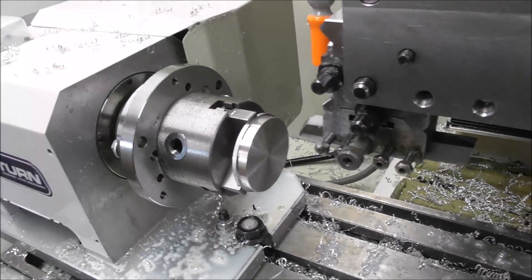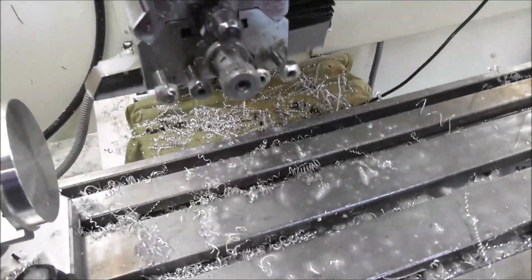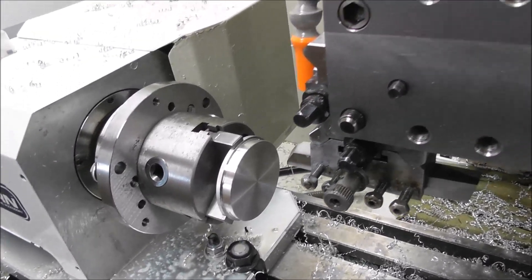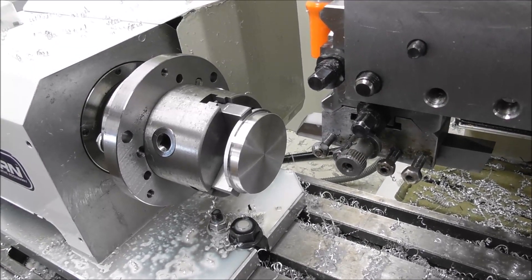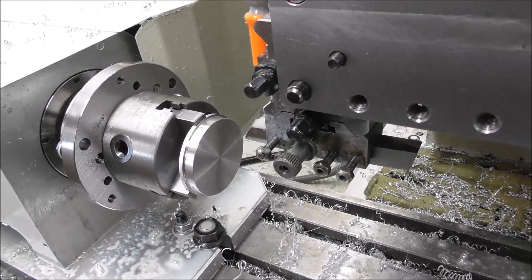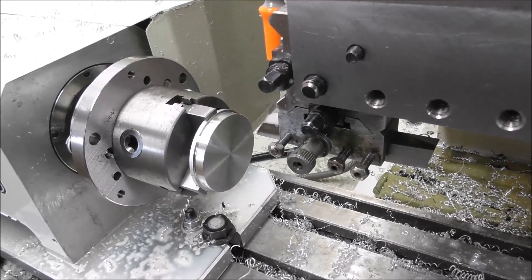There's not a lot of power in RapidTurn. This is only 60 millimeters diameter, 6061 aluminium, and I've taken fairly aggressive cuts so I could use the chip breaker. The tool has a little scallop ground in the end and it needs a high feed rate to turn the chips into short chips. It was on the point of stalling — I could hear the motor slowing down as the tool wore, until it actually stalled the motor and skidded the belt. Next time I'll program half a millimeter deep cuts instead; I really don't want to skid those belts again.